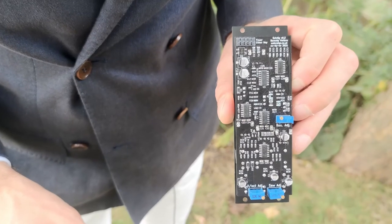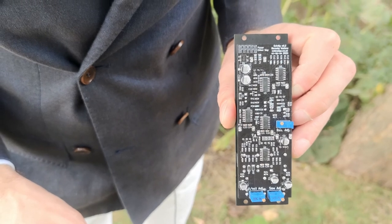So I think it's reasonably noob friendly with the caveat that most of the parts are 0603 surface mount. I would recommend this for people just getting started with SMD because the parts list is pretty cheap, so you can afford to try and debug it if it doesn't work at your first go. The only tiny piece of feedback that I would give is that there are a few part substitutions clearly indicated at the start of our video. And the holes on the front panel are not the same size for all potentiometers.